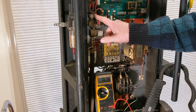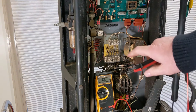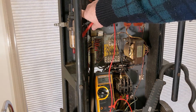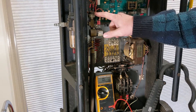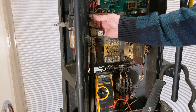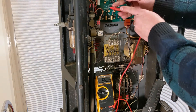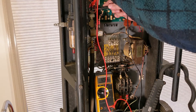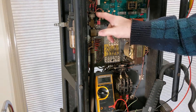I'm also going to check this sensor here for the air pressure. I need to plug in compressed air or nitrogen into this input and set this dial to 60 psi. The machine won't allow it to start if it doesn't have 60 psi here. This looks like a normal pressure sensing switch that's open until you apply pressure. So right now I'm expecting this to read open — and it does. So I'm going to hook air up to this and see if I can get this switch to close.